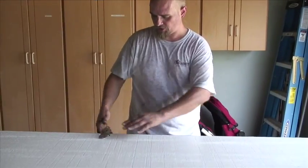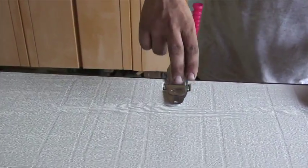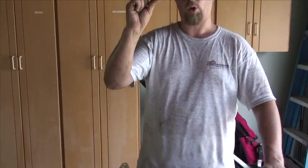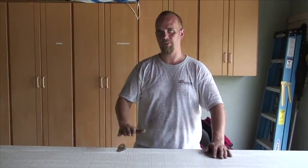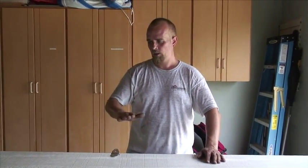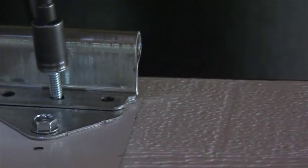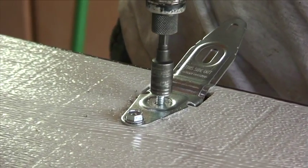And these hinges, the reason they clip into the back of the panel like this is when we stack them up, these panels never separate when they're opening. Most doors, when the doors open, there's about a 1/4 inch gap at the top. These doors never open up, so kids cannot physically stick their fingers in here and pinch them. If you're running it down manually, you can't pinch your fingers in these doors. When you run these into the door, the urethane melts around the screw, so you never end up with any air leak.